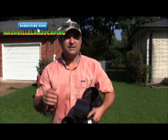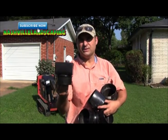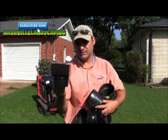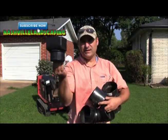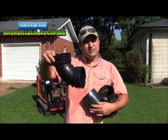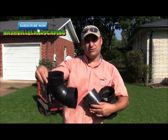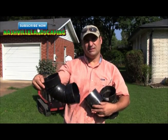Whenever we build one of these systems, we use the proper adapter for the downspouts. They come in two sizes — there's a small and a large. This is a large. That connects right up on the downspout. If you go down a little bit underground, there's going to be an elbow. This elbow goes right underneath the downspout so your pipe is straight up and down into the elbow — it doesn't look funny.